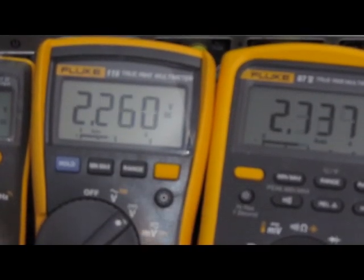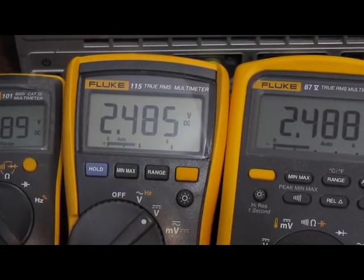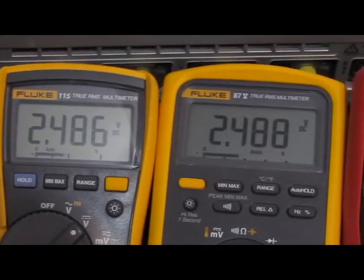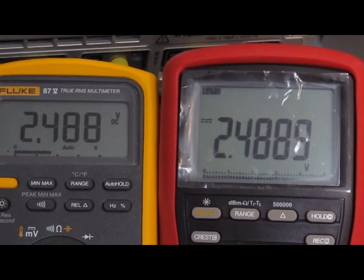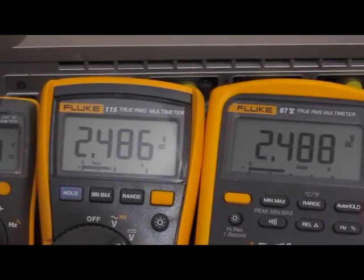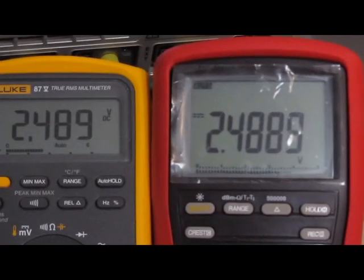This is currently at 10 hertz. You can just see how fast this Brymen is. It's currently looking at 39 hertz. See, the Brymen is actually aliased now. But the bar graph's definitely showing me an indication that the signal's moving. Which is kind of the whole intent of that feature.